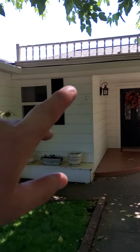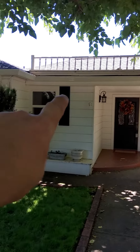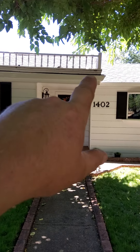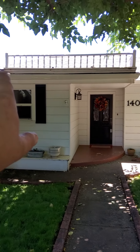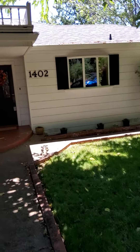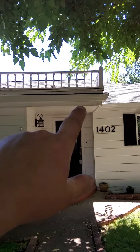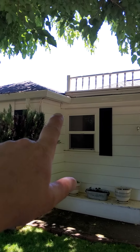When you walk toward it you'll see this dip right here and think something's wrong — but actually no, the dip is intentional. There's a scupper drain here so the top of this porch cover does not flood. Water flows from the valley runoff right to that scupper drain, which goes through this gutter. I walked it — I believe the cantilever goes past here to the roof end, but I kind of doubt it because it is lower.